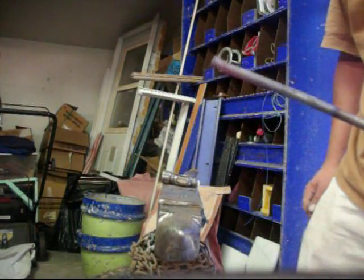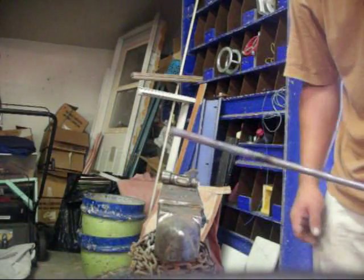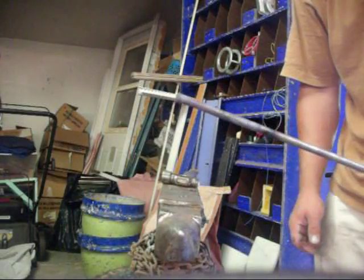Just a tiny little bit of an upset. Now I'm going to go heat this up, cut it off to the length that I need using a hot cut, and then we're going to stick it into the punch plate and make a rivet.